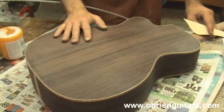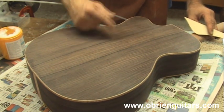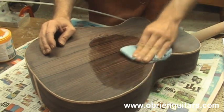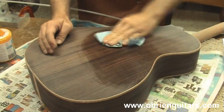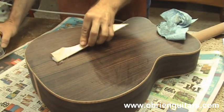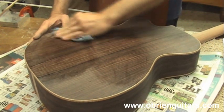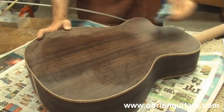So I sanded the entire guitar lightly with 320 grit, took it to my air and blew all the dust out of the pores, and now I'm going to apply a second coat. The second coat goes on just like the first coat. Make sure you keep it clean so you don't have a lot of sanding to do — you can really burnish it in there and wipe it extremely clean. What I'm going to do is apply this coat, lightly sand it again, remove the dust, and then do a third coat. That's all it takes. I think you'll be happy with three applications. If not, rinse and repeat until you are.